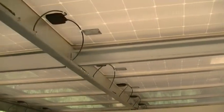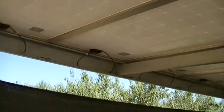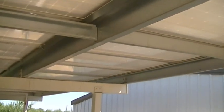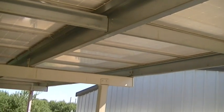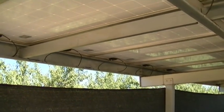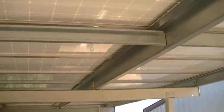So I have a gutter system on both sides. On the C-purlins, whatever water leaks through is usually on the outside downside — water will not leak on the inside. On the upside, when it drips down, it catches in the C-purlin and runs down the line. Where there are butt joints for the purlins, I silicone the seam on the bottom and up the sides to seal them so they don't drip through. Everything is pretty drip-proof — sun protection and rain protection for your RV.